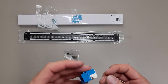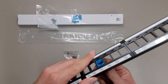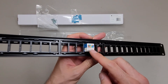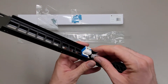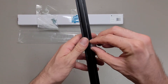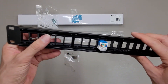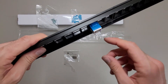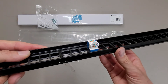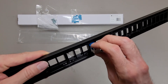One disappointment with these jacks is when they're installed in the patch panel — as you can see, the conductor slots are pointing down. There is a chance that when you have your cables installed, if they're putting a downward force, the conductors could slip out. I believe that's what the zip ties are intended for — to lock that in place.